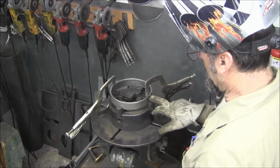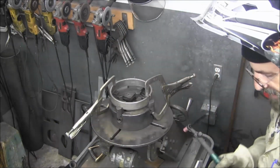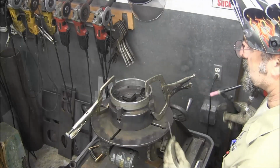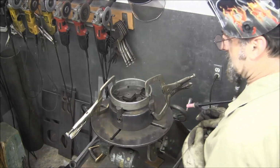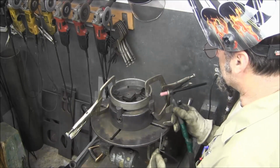And then I leave it, this is about a 1/4 inch gap. It might be a little bit heavy, but I can go ahead and fill that in with the Heliarc and have the ring closer to size, and just being able to machine it, press it on, and then turn it once the impeller is set up on the shaft.